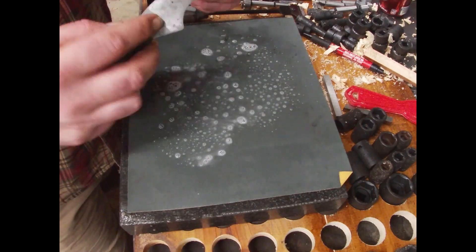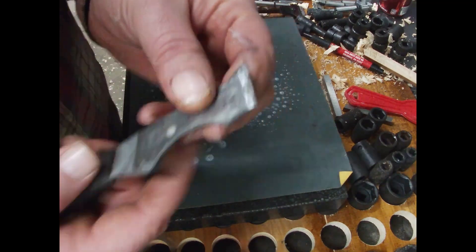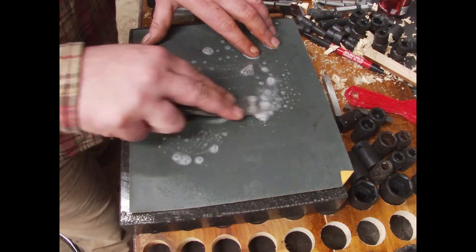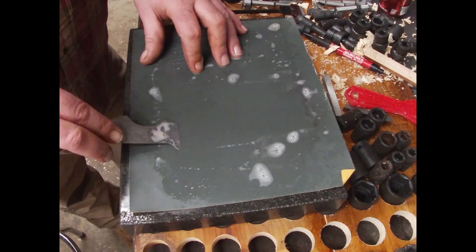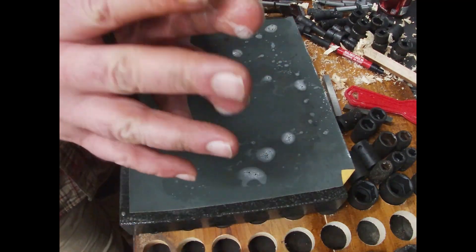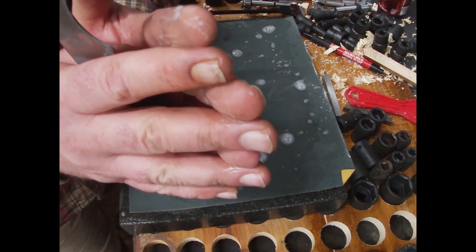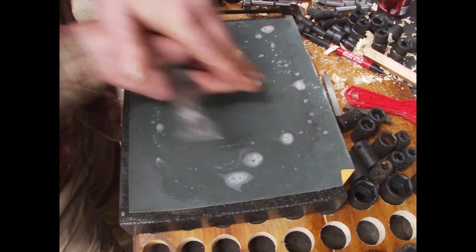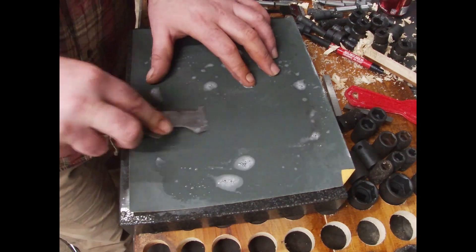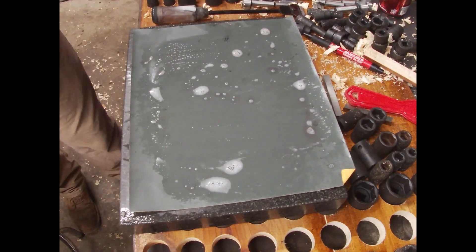New sheet of paper — let's get the edge cut on this thing. As you can see, that edge is starting to come back alive. I turn it back over and rotate it to get an even cut on each side. When you sharpen something, the edges become a micro-fine serrated edge. Running it one way causes the edge to roll to one side, so flipping it on each stroke keeps them in line and makes the edge nice and sharp.